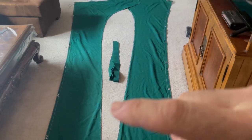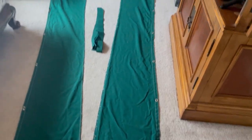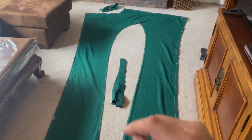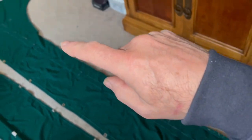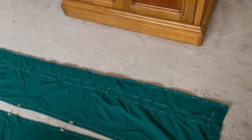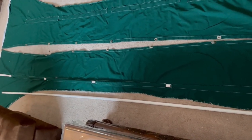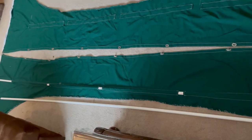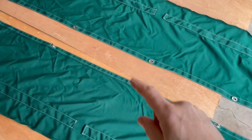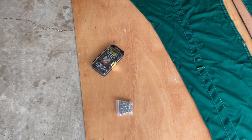The first thing was to separate the seam on the spine of the original mainsail cover. I've also removed the collar from the aft part and the collar from the top where the throat is. I cut up a bunch of strips that'll serve as batten pockets, and now I've sewn those pockets to the inside of the cover. There's a series of four of them with about a two-inch space in between. On this side I've already inserted the batten, which is a half-inch PVC pipe. I just need to sew the aft part closed and cut that a little bit shorter.